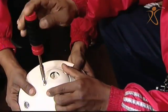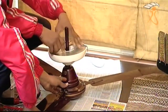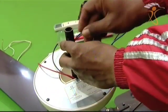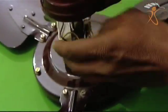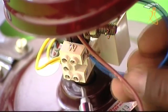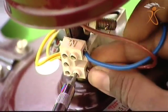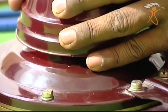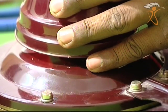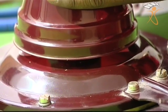Step 4: Install the Aero Comfort System on the hanger pipe after removing the existing wire and ceiling cover. Ensure that the hanger pipe is left out with enough space to get mounted back on the ceiling. Push the electric wires of the Aero Comfort System through the hanger pipe and fix them on the electric socket. Using an electricity tester, ensure the wires have been fastened properly into the socket and are not visible out of the fan cap. Fasten the fan cap screw, ensuring the cap is not touching the fan motor, as it will make noise while the fan is running.